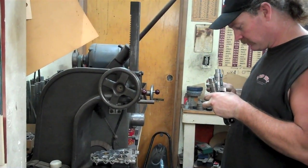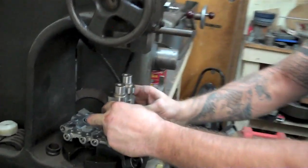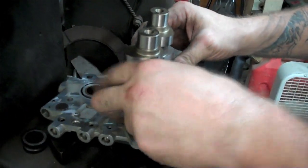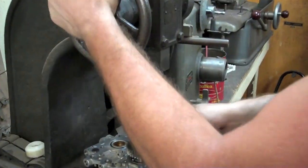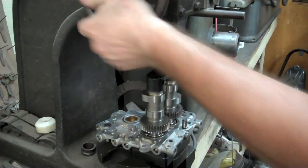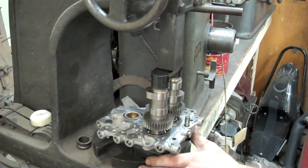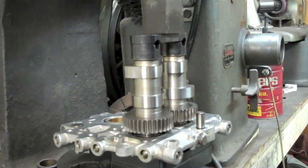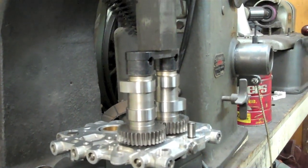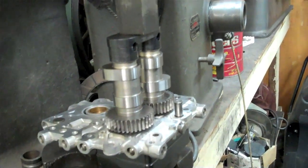Line them up for timing again, make sure I want it. Set the tube in place, set the tool on the tube. I just kind of want to evenly walk this tube down into the bearings. With the arbor press I just know I'm not going to get too carried away with a lot of poundage on it, and I set them in my sleeves.